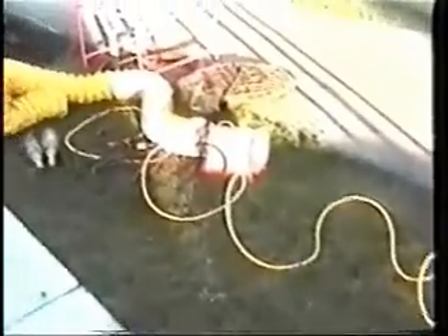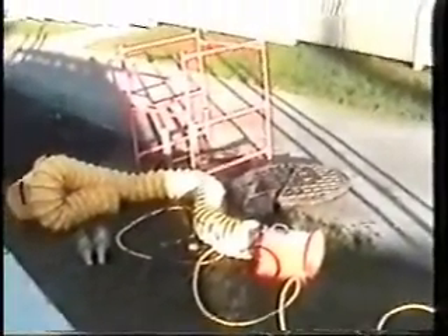I'm just going to wait for that to happen. In the meantime, the hole is getting more set up. We've got a blower there — the orange thing is a blower — it's attached to a lot of pipe, it's going to blow fresh air down there. I've got my set of lights set up, the manhole guard is in place, and the ladder is in right now. So we're just going to test the hole for gas and then we should be good to start pumping. Now I've got the blower attached and the line's going down in the hole. Let's go on down.